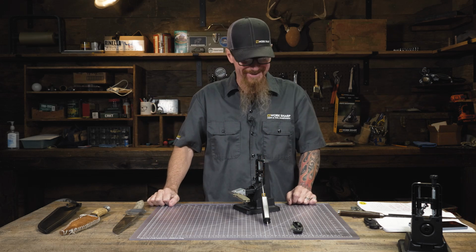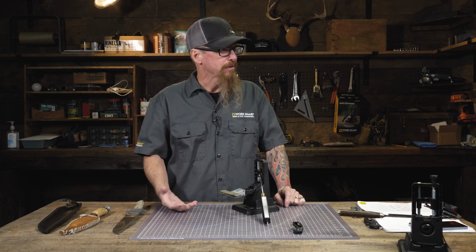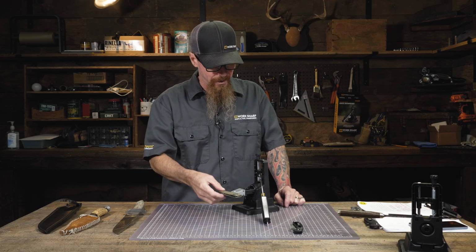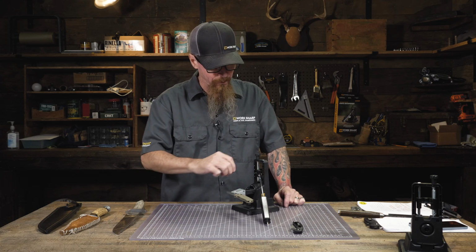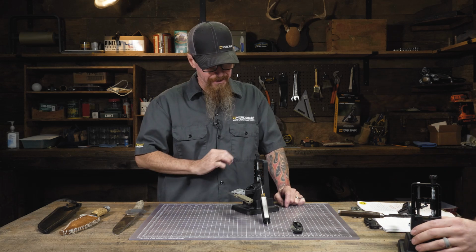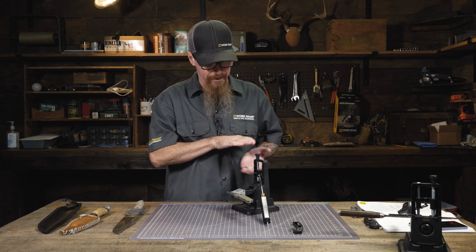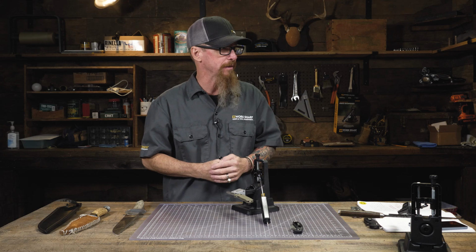What does that sweeping stroke do that the back and forth motion doesn't? For me, I believe it gives me a cleaner looking edge. You don't get striation marks traveling 2 different directions. You'll have some this way as you're sawing back and forth. So I get a nice cleaner bevel, and I like pushing into it because that just helps refine that, rather than pulling, sharpening off and pulling metal away from the edge. You're pushing in to help refine that bevel or that burr.